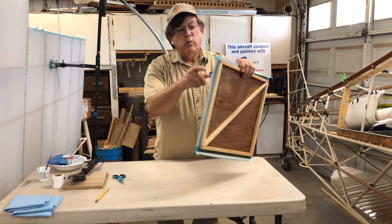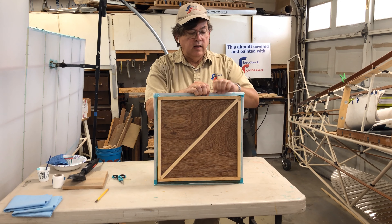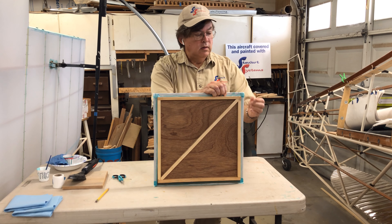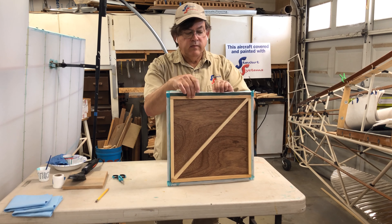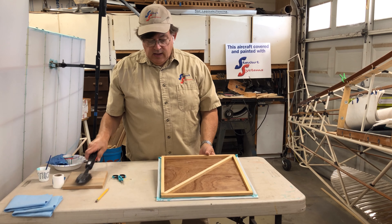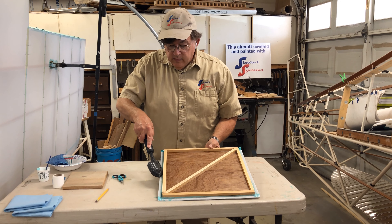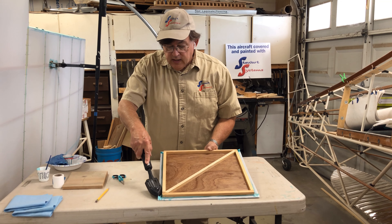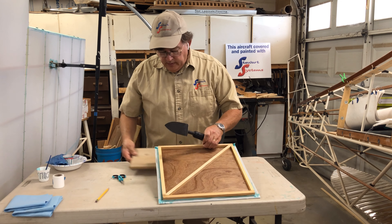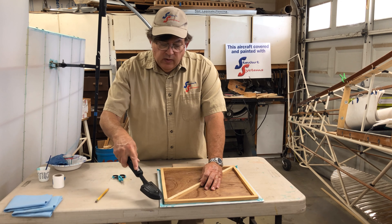If it were a door, this would give me some thicker edges, and this edge will shrink down when we get heat on there later. I'll lay this one down also and do the other side. Now I can take the iron in here and really lock that in just like I did on the top. If I do have wet glue here, I can go ahead and hit it with the iron and that will help to stick it even though the glue is wet.